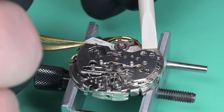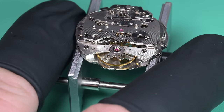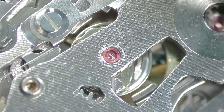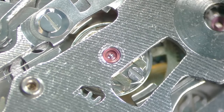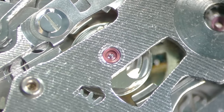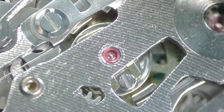The balance seemed to fire up all right. Press it down fully once it's in and tighten the screws. Checking the spring and how it's breathing — it's looking pretty good, spring looks flat, no major issues. I'll also check the minute recording wheel and the chronograph wheel: the arm on the chronograph wheel flicks that minute counter over. Speeding this up — checking how that finger interacts, making sure it engages the middle tooth correctly and that it clears after pushing that tooth over. It does clear with just the tiniest gap — exactly what we want.